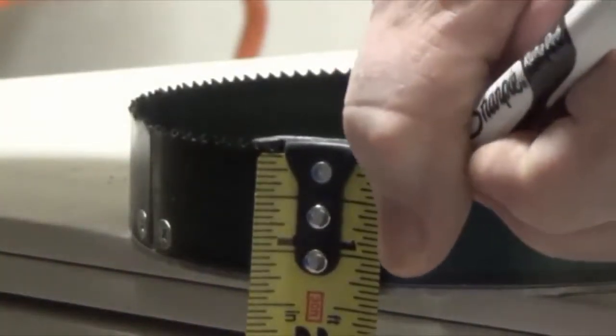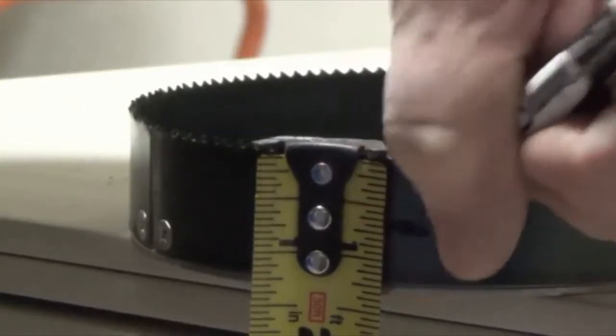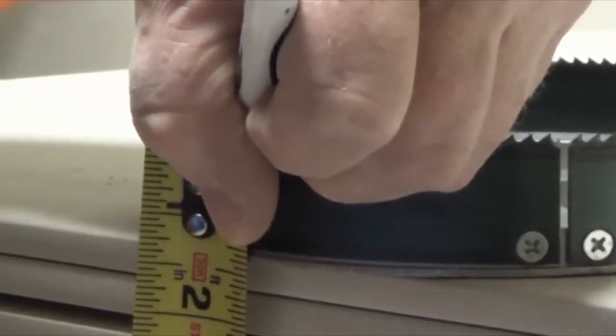Since the depth of the first sheet is 5/8-inch, place a 5/8-inch depth marker around the 6-7/8-inch hole saw to prevent from going into the second layer of the wall.